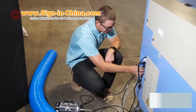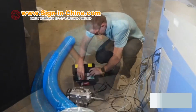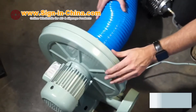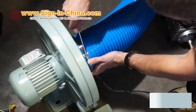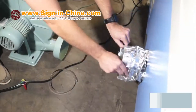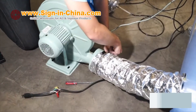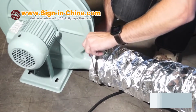Next, we will plug in the power cord for the blower motor into the back of the machine. Then we can attach the blower exhaust hose using the blower hose clamps and Phillips screwdriver. Take notice of the blower orientation and ensure that the blower exhaust hose is installed into the blower exhaust port. Next, we will install the debris hose located inside the working area. This setup is responsible for removing small airborne particles and fumes from the workspace during operation.